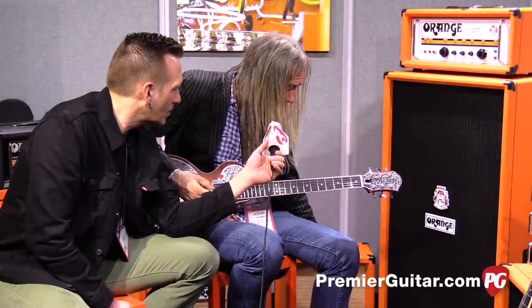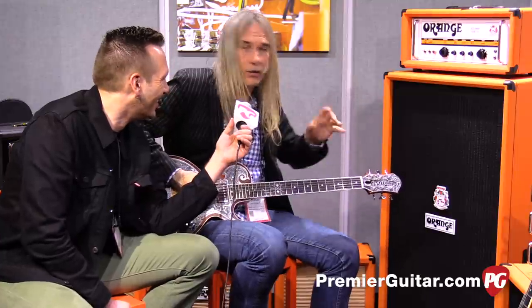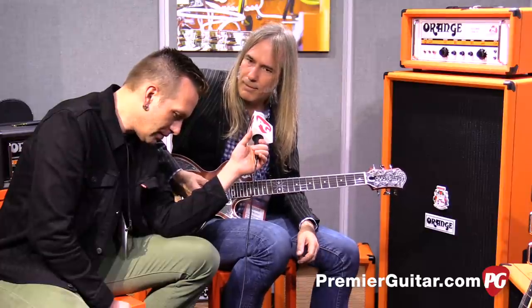You could push an amp with it if you turn the volume up as well, but the actual compressor itself will take +4 at the input. You can hang it out of a desk and punch snares up with it. It will take, like, +4. I think I measured 6.5 volts of signal clean with the output flat out and the squash flat out. But whatever you're putting that sort of signal into after it will be distorting, of course.